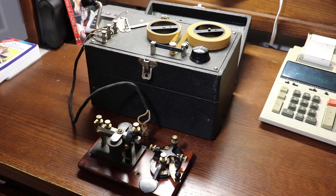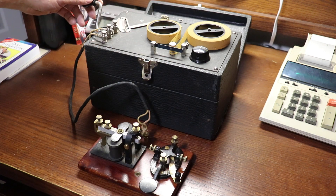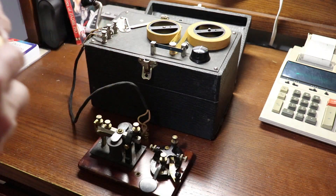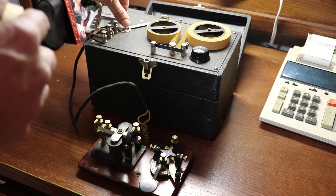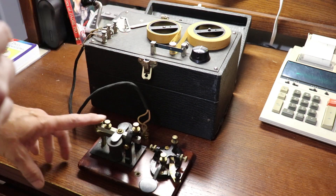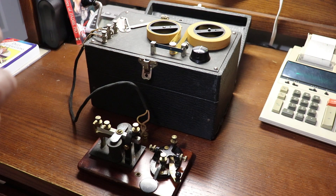He learned Morse on it, and I thought I would take a moment to show radio amateurs, telegraph historians, and others how this device worked. It's a pretty simple device — really a phonograph motor; in this case, a hand-crank phonograph motor. There's a battery source — in this case, a number six dry cell — and a spool with the perforated tape. When one starts the device, you can vary the speed with the regulator for the phonograph motor, and it draws the paper tape through the spring contact, which is in series with the battery and a learner's set. This one's manufactured by the Signal Electric Company of Menominee, Michigan, and they were very commonly used with this type of Instructograph. Later models used AC and an AC phonograph motor, and they also often had internal CW oscillators as well.